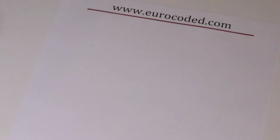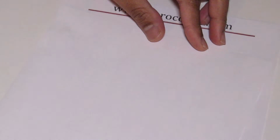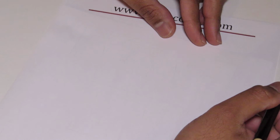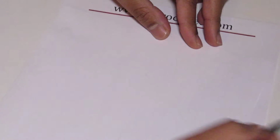In bridge engineering with pre-stressed precast concrete beams, there are three major forms of construction. I'll show you what they are. First one with a shallow, when you have a requirement to have a shallow construction depth, you use infill decks.